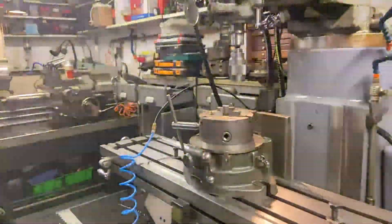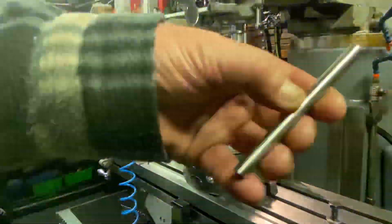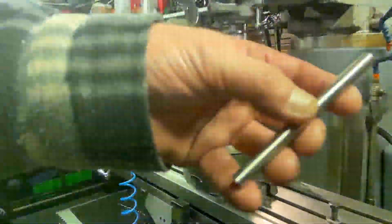It's very straightforward, there's no clocking up involved, and all you need is a piece of stock. I use high speed steel ground bar because I know that it's nice and true and straight, but you can use any piece of stock as long as you know it's true and it'll fit into your chuck.